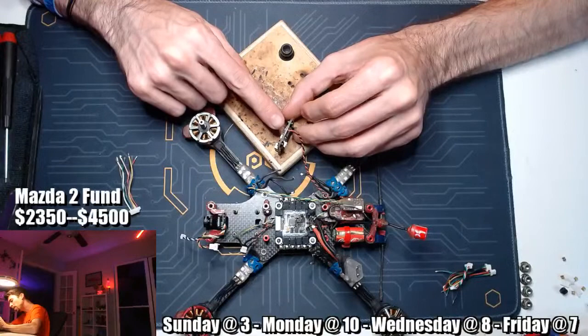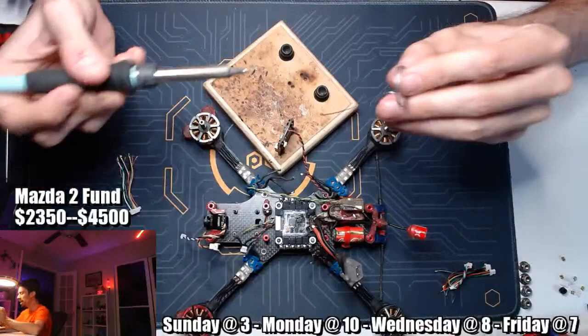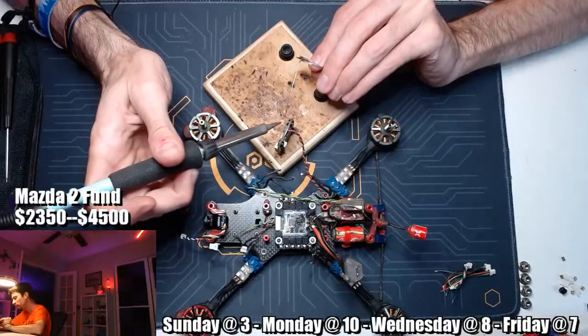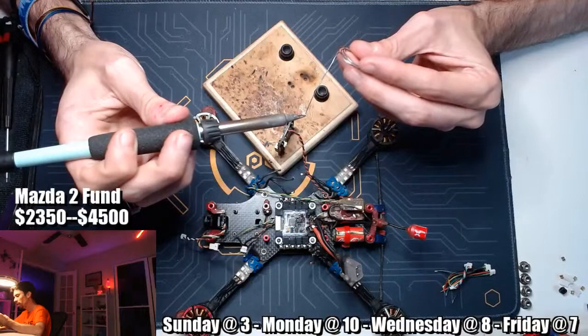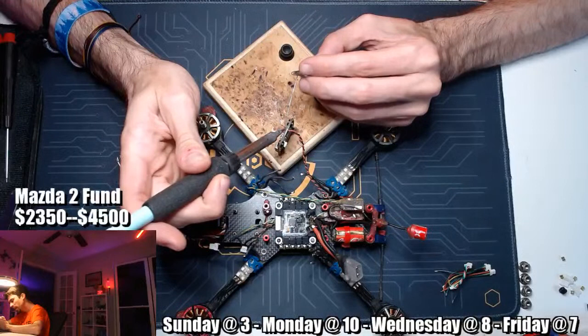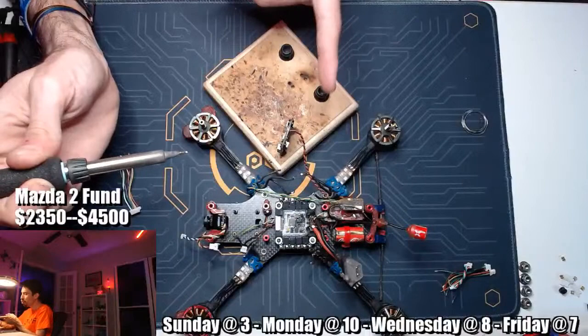So now all you're going to do is put heat on one side with the tinned tip of the soldering iron, and then you're going to try to feed solder either from the other side, or a lot of times you can feed it in through the same side. I'm going to feed it in through the same side here. So we're going to tin the tip of the soldering iron, we're going to apply the heat, and then we're going to add a little bit more solder. So there, and there we go. And you're going to try to push a bunch of solder in there because you're trying to push solder through the through hole to get full penetration.